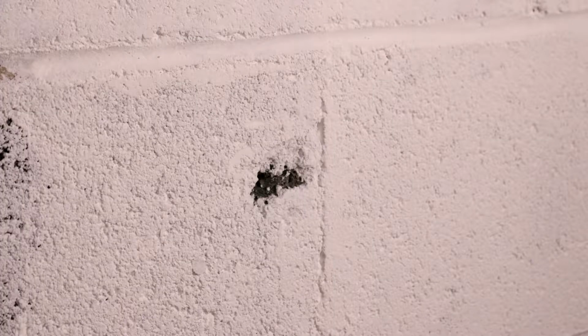I got so excited to see some color on these bare walls that I started applying the dry lock, and it outlined perfectly the bad places in the walls. And so I thought that was a good idea. It wasn't. The cement patch will stick a lot better to bare concrete. It'll probably still stick over this paint. Worst case, we'll do a video on how to grind out these spots with a grinder and reapply it.